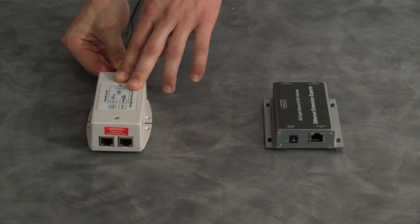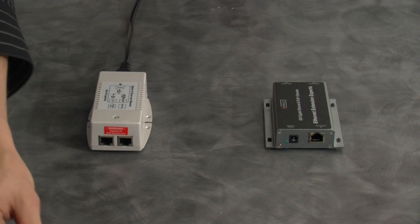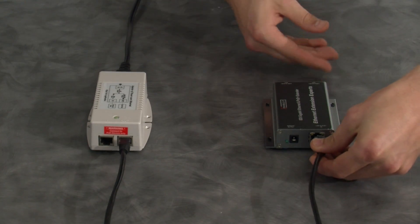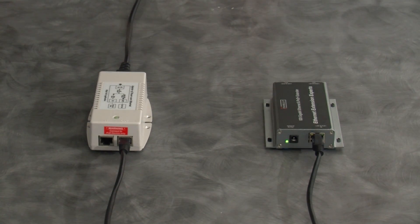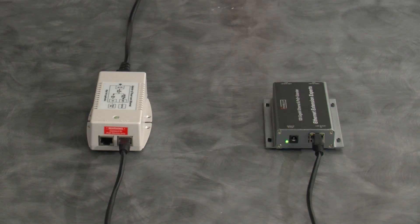First, take the 360 injector and power it on with the power cord. The green LED will light up when powered on. Next, take an ethernet patch cord, plug it into the PoE out port on the injector, then attach the other end to the LAN PoE in port on the 828 device. The green power LED should now be lit on the 828. The 828 standalone will extend your ethernet PoE signal 800 feet total, or 400 feet on each end of the unit.